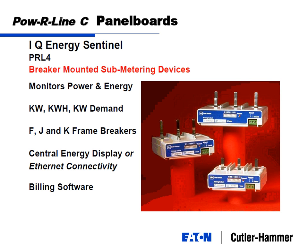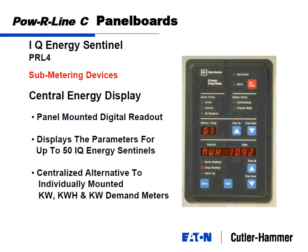So you can take it out in some Modbus form of communication or Ethernet form of communication and bring that in and be able to gather that data, send out energy bills, or track usage over time to see how much energy you saved when you replaced the 30-year-old HVAC unit with a new one last year. How much energy did I save when I paid the extra to upgrade to a better efficiency? All that's out there nowadays. And it's just different methods for metering.